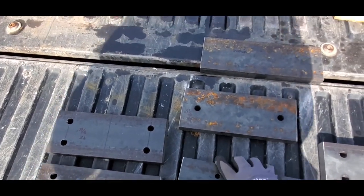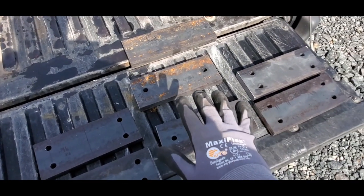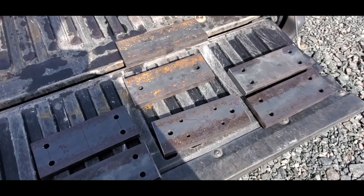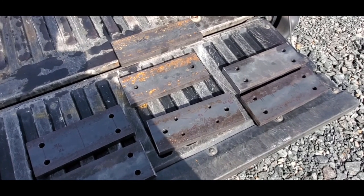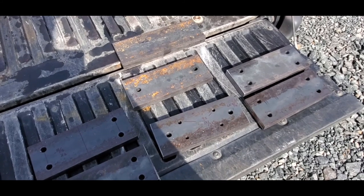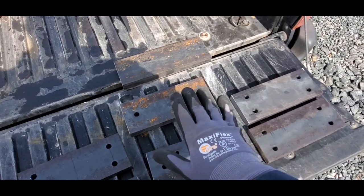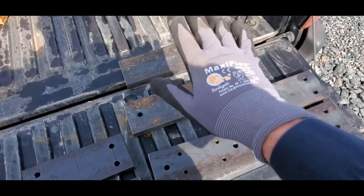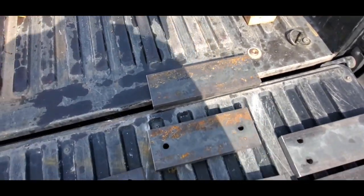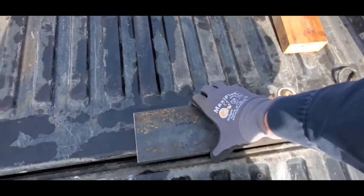And that will be there to load share, take some of the load from the trolley beam up to the building frame. Those tie rods will not be run in completely tight and tensioned. They'll just be set to the length, and then as the trolley beam begins to deflect, it will share the load to the building frame through those tie rods. And I have a little bit of drop from that operation.